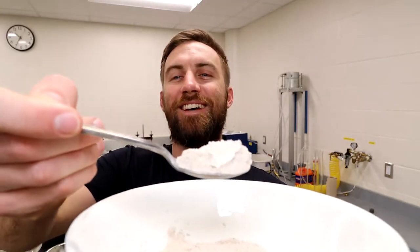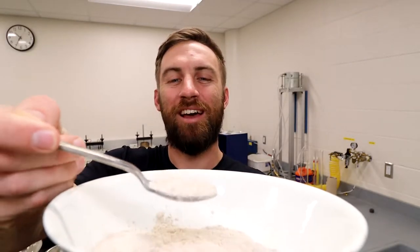In this week's video, we're going to be reviewing the hydrometer analysis. Now, just like last week in the sieve analysis where we found the grain size distribution, the hydrometer analysis is also used to find the grain size distribution, but instead of coarse grain soil, we're going to be using our fine grain soil. So all that fun stuff that passed the 200 sieve, that's too small to use a sieve on, we use the hydrometer analysis to get that tail end of the grain size distribution curve.